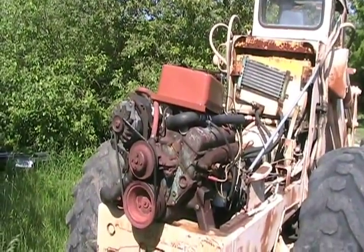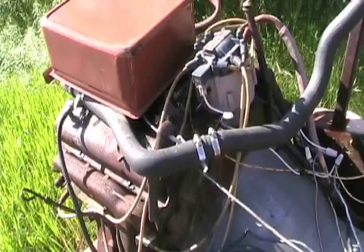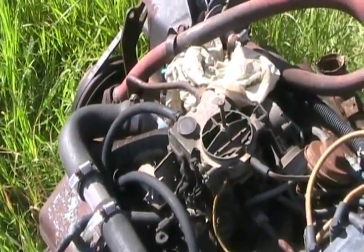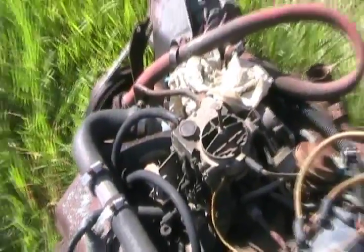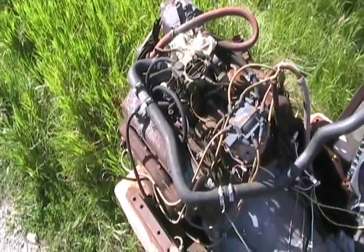I think I'll put it on this year. I just extended the coolant tube to run it to the radiator — it's just a piece of copper pipe in the middle. Got the fan set up to run all the time. This motor has a 2-barrel carburetor. It actually needs the jets opened up a bit since I'm running it with open exhaust manifolds and it's a bit lean. It works good other than that.